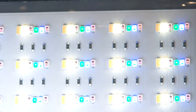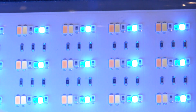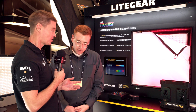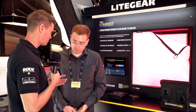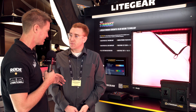The idea is that we've taken a lot of the guesswork out of it, so that when you mix to 2,700 Kelvin white, you're getting a very high-quality, full-spectrum, true — not-too-magenta, not-too-green — 2,700 Kelvin light. We're also working on a system where you'll be able to tailor the light to particular camera sensors, because all camera sensors are slightly different and react differently to various lights, so you'll actually be able to tell the system which sensor you're using and it will adjust the light accordingly.